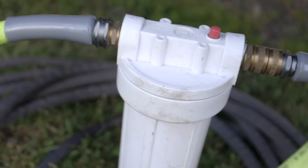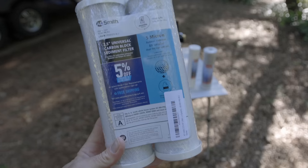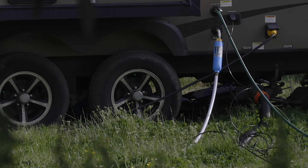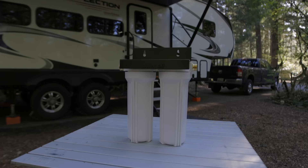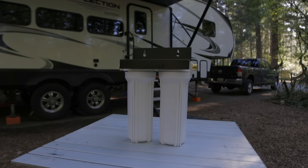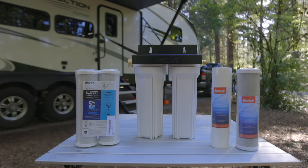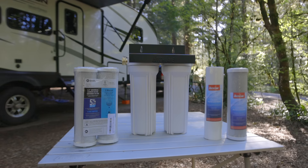The next thing I gleaned from Jason's video was the water filter. We've been using the whole house water filter with the RV and it's fantastic. I much prefer a carbon block filter that brings it down to five microns rather than a granular carbon filter that only takes it to 20 microns. There's less waste involved. The one I saw on his channel really takes it a step up and doubles down on filtration for the RV. You can dial in exactly what you'd like to filter at a good price point. In the long run it's cheaper for filters, less waste, and it's just a better way to filter the water. It would be tough to build this filter kit for cheaper than you can get it on Amazon right now.